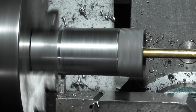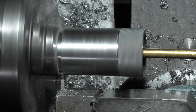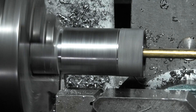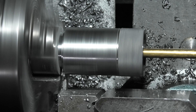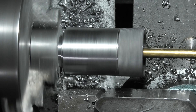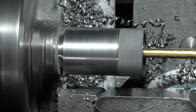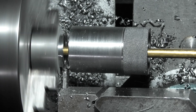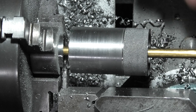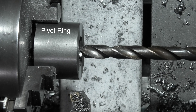I'm just widening the groove a bit — I've just pulled the tool over so it's a wider groove, just in case I missed the end of the hole. It was out by about a sixteenth of an inch and you can see that has stopped it hitting the lathe. Now I have a piece of one and a half inch steel in the lathe and I want to drill a 3/8 hole about three quarters of an inch deep.